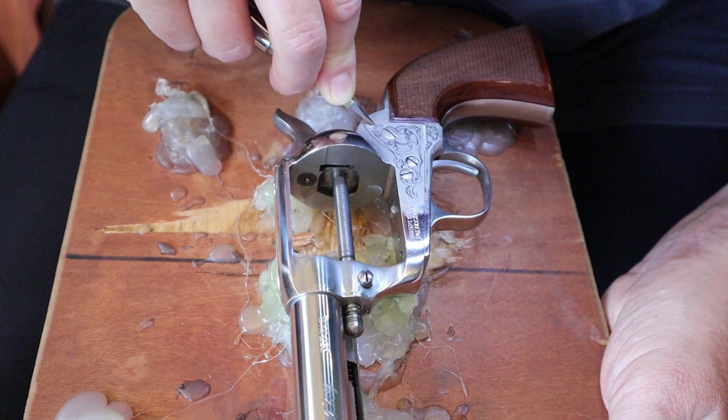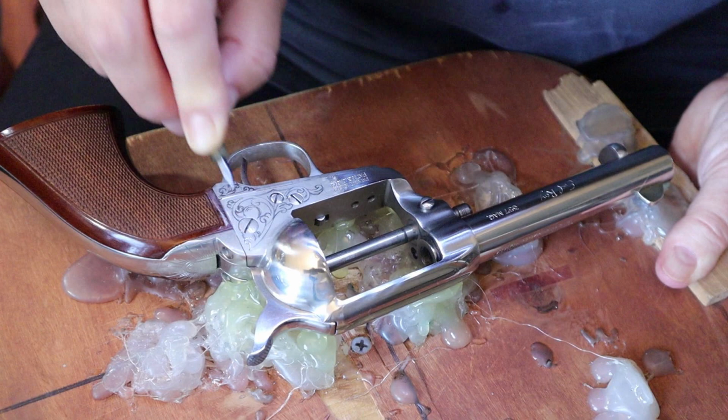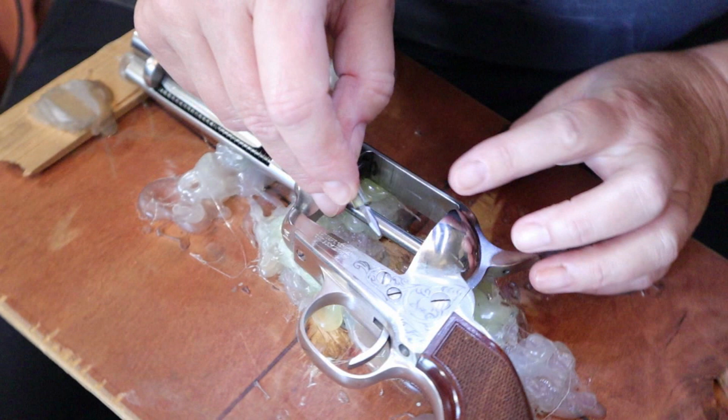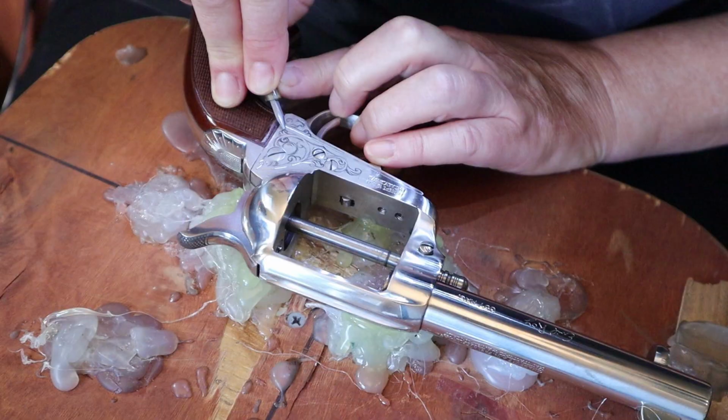With this little jig that I've got, I can grab the edge of the plywood and move the ball vise. And so it's the same principle as when I was working on the cylinders. I'm moving the piece of work into the graver, and with my right hand I am adjusting for the bevel. So it's a V cut, and it just depends how I twist my wrist as to where it's going to cut the bevel. You want the bevel to the outside of the design all the time.